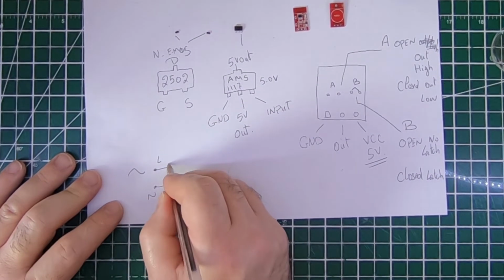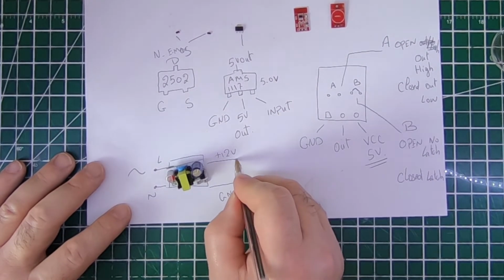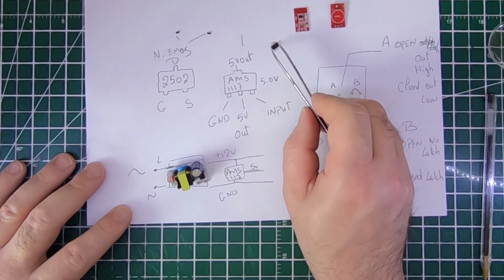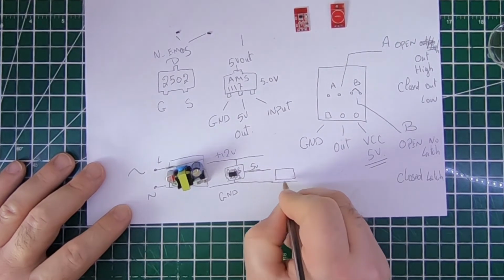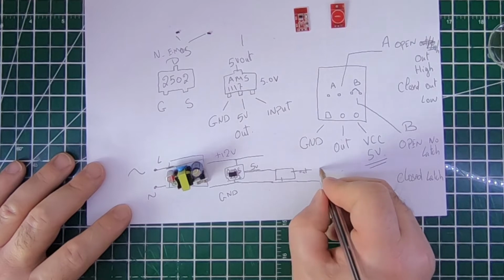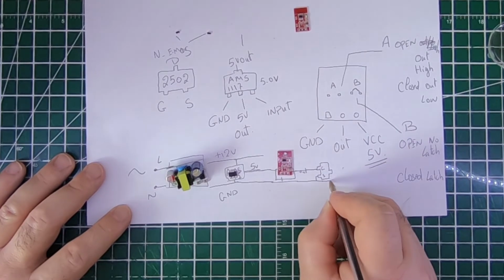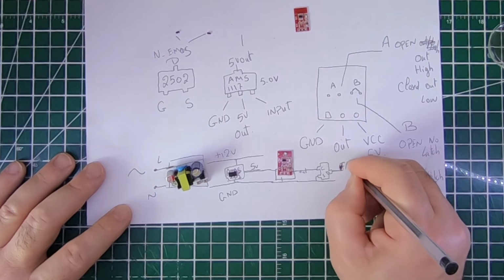And now to connect everything together. So we start by plugging the supply into AC main. That goes into the power supply, and we get plus 12 volts and ground out of it. Next, we connect the 5 volt regulator to ground and plus 12, and now we have ground, plus 5, and 12. Connect 5 volts and ground to the capacitive switch, get the output into the gate of the MOSFET, then connect the source to ground and connect the drain to the negative lead of the LED or the fan. Also connect the plus 12 volt to the LED and to the fan, and there we go, we're done.